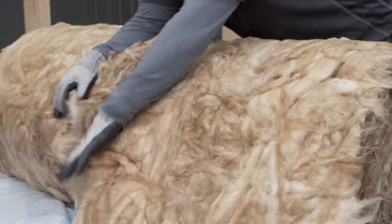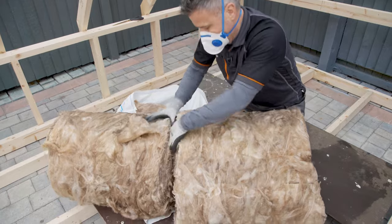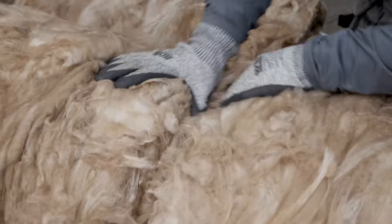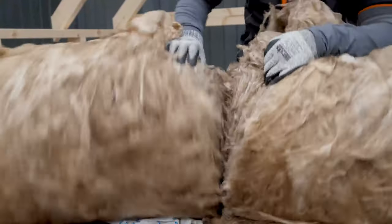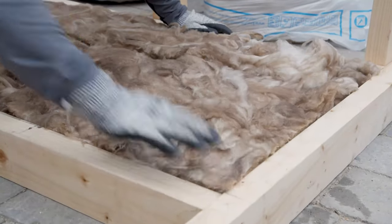There is a manufactured cut in there — although it's knitted together, you can just pull it apart. It's wise to do this before you lift it up into the attic area. You can see the seam coming apart there, and what we want to do is make it nice and snug up the side all the way along.